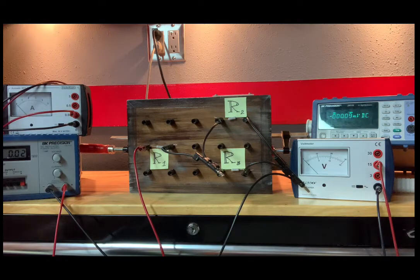So looking at that table, the second column says analog value from equation 1. Okay, so we just took a bunch of voltage and current measurements on analog instruments. And from those two measurements, we can determine the value of R1 and the equivalent resistance of R2 and R3 connected in parallel. And then for the bottom, the equivalent for R2 and R3 connected in parallel while simultaneously being connected in series with R1. So we can use our equations to determine that, Ohm's law, V equals IR. Then it says digital value. And they want you to compare.